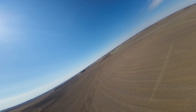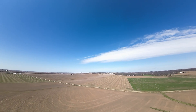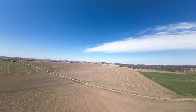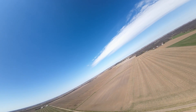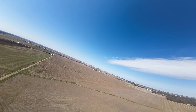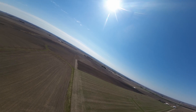I have my craft set up to continuously trim servos and it leveled itself right out. It's flying smooth right now. It's blowing about 10 to 15 miles per hour — I'm flying it in this wind because if it can handle this, it'll fly great in calmer conditions. I just activated return-to-home; that's me down by the car. I'm getting in the car because it's pretty nasty out. Just checking that return-to-home works.